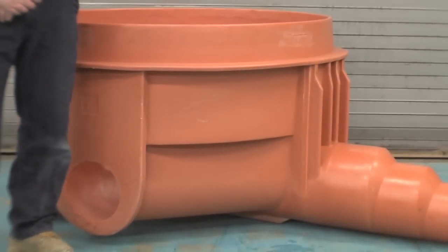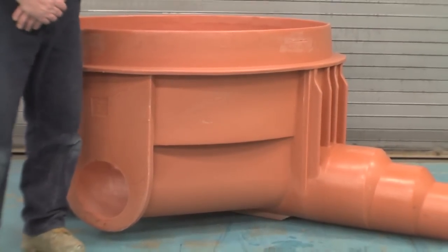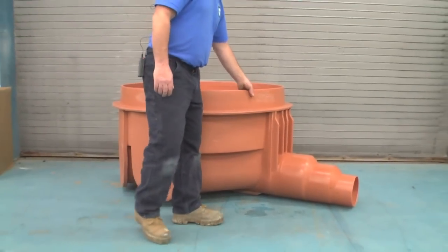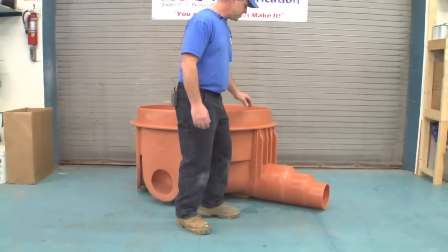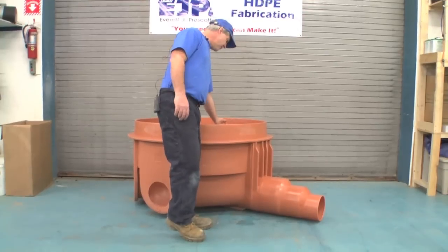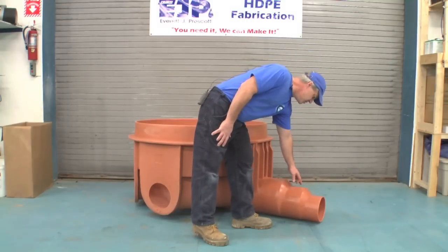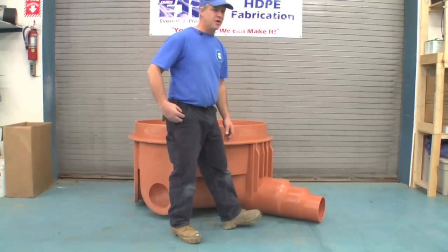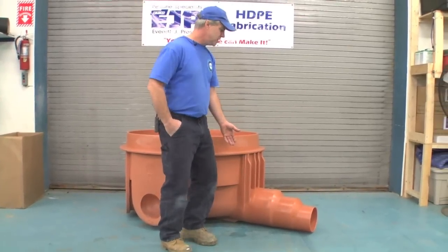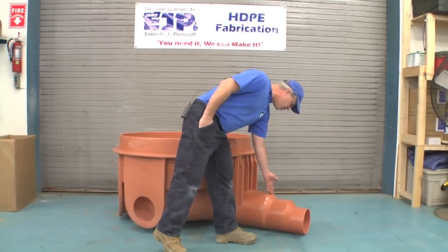At this time I'd like to go over some of the features and benefits of the High Density Polyethylene Manhole from Rhino — some things that you don't have with a concrete structure. The first thing is the sized outlet nipple, which keeps your flow channel line exactly flat on the bottom. These are sized for 8, 10, and 12 inch SDR-35 pipe so that the pipe can be belled directly onto that nipple. If you need the 10, you cut it off; if you need the 12, you cut it off here.